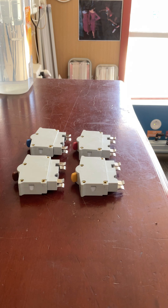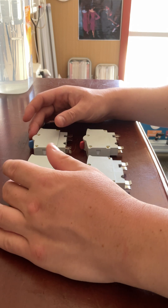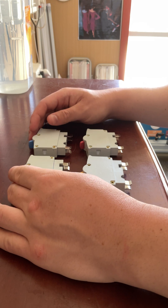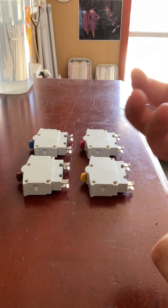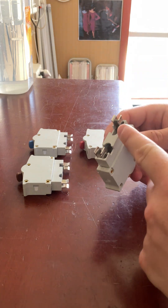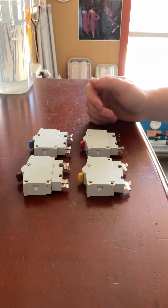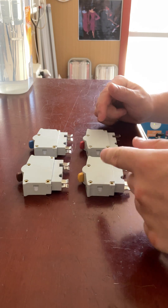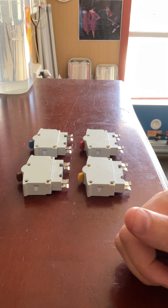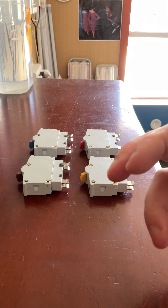I thought I'd show you their circuit breaker range. These are a plug-in circuit breaker — they basically plug in, so these would replace the old plug-in fuses from back in the 40s or 50s. Before we went to breakers that you could just flick up and down, houses used to have a plug-in fuse which took the same base. That was the way most switchboards were back in the day. In a lot of older houses, you'll still find switchboards that have these breakers, or they might even still have those fuses that haven't burned out.